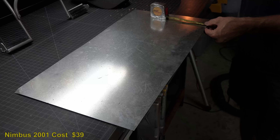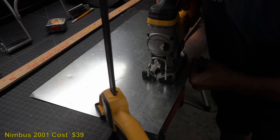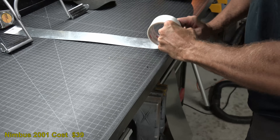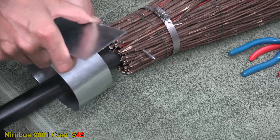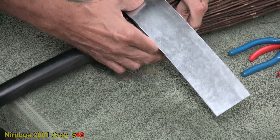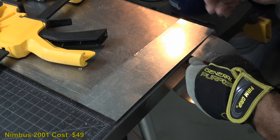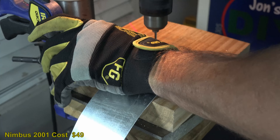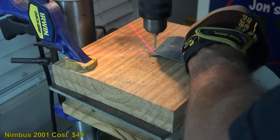Now it was time to start on the banding. The Nimbus 2001 is pretty easy — one banding. So I cut a piece of tin three inches wide. I used the same process I did with the earlier brooms and bent it around a roll of duct tape. The piece of tin was $10 from Home Depot. I was really on a roll here so I continued into the night — sorry for the dark footage. Take your rolled banding just past your steel rod and pull it tight down on your bristles. Mark your piece a half of an inch longer than the edge, then go back and cut off the excess. At the half inch mark, I make a slight crease in the metal by clamping it down on the edge of my workbench under some metal — a board will work here just as easy. I know I should have drilled my holes first and then made the crease, so yes, I actually did this backwards.